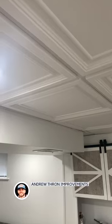Next, you're simply going to attach the vertical pieces of drywall to the OSB, and the piece at the bottom is going to mount directly to the mounting studs. Then all you have to do is cut around the vents, finish the drywall with joint compound, and here's a look at the final result.